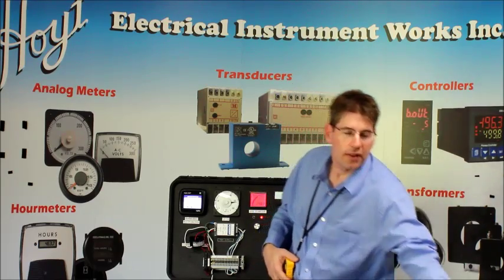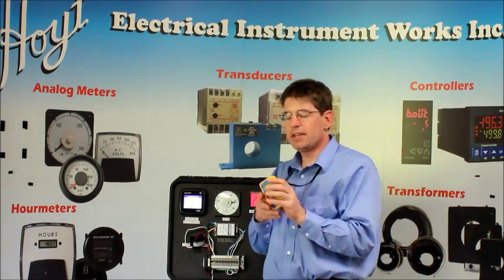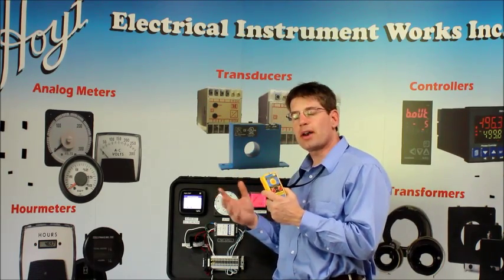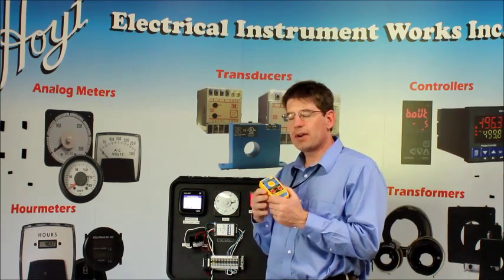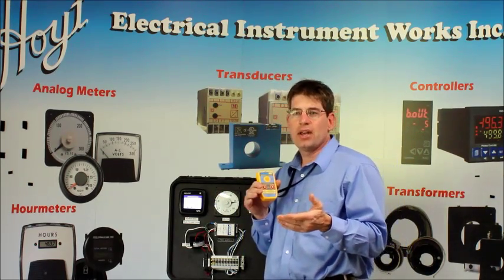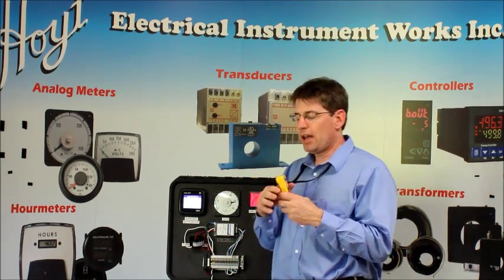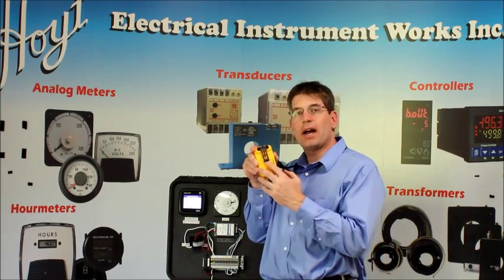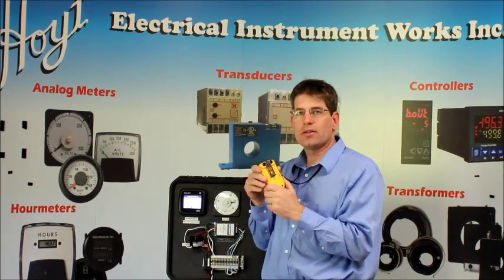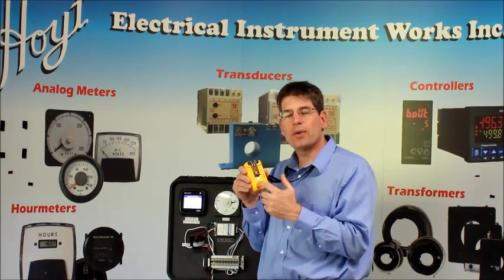The next product I have around my neck is the body product — the H288SVD. It's a similar product in that it detects voltage, however it has a wider range. This will go all the way from 80 volts up to 44 kV. On the back, you can mount it on your belt or tie it to a hot stick if you wanted to detect overhead power lines.